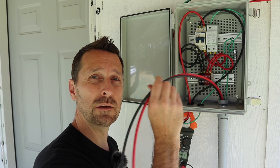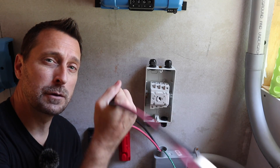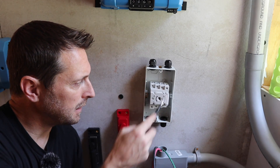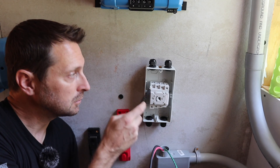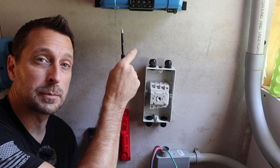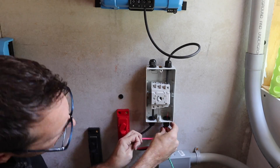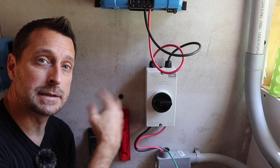Now the last thing to do is to connect our PV lines that will go into our MPPT down here on the bottom of the din rail. Now we're inside. Before we connect our PV wires to our MPPT, we of course need to run it through our PV disconnect. With these IMO disconnects they are numbered one through eight. We are going to bring in only two lines — from two over to one. Our positive line is going to come into two and go out through one and up to the positive on our MPPT. Our negative is going to come in at eight, and then from seven we're going to continue the negative up to our negative on our MPPT. With that, we've got all of our PV wiring connected. Now onto the rest of the DC side of things.